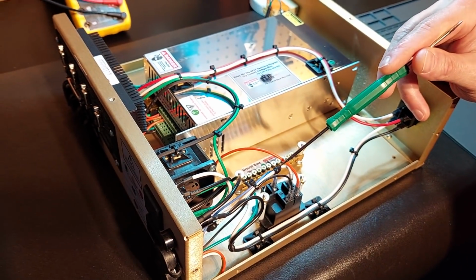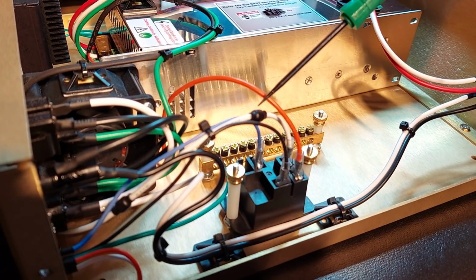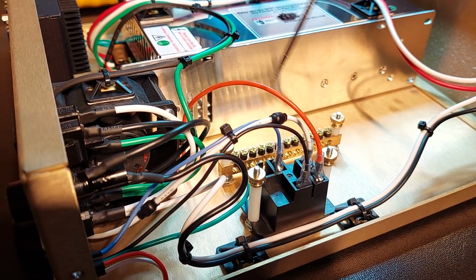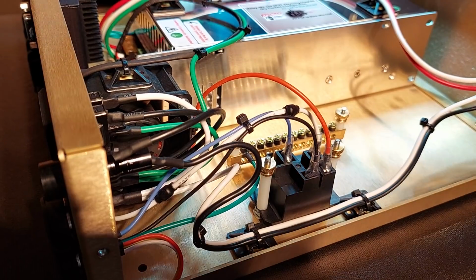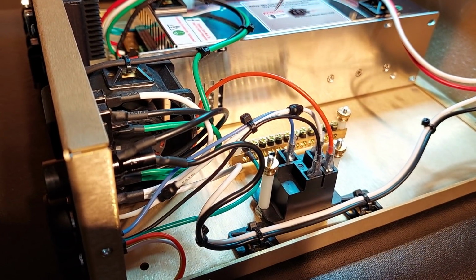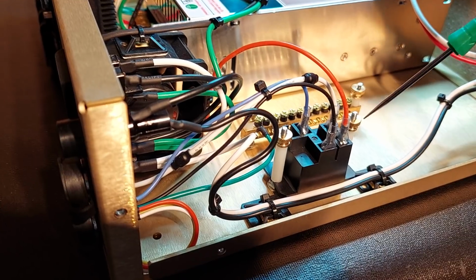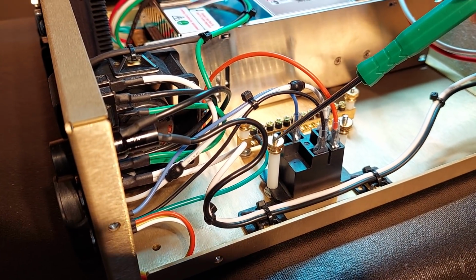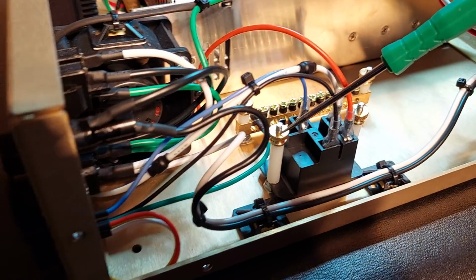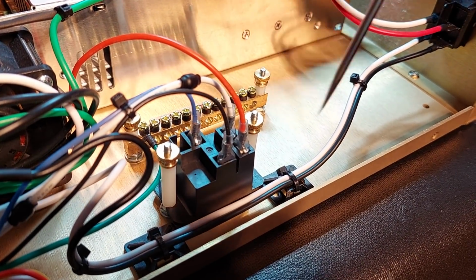What you see with these little nodules on this white lead going to the G540, which is the signal cable, is ferrites. So again, we don't have to use double shielded cable because he has ferrites installed all the way through the length of this cable going back to the drive. It's then toollessly mounted with thumb nuts to allow for simple servicing. If he had to change a relay out due to a failure, he could change this out in seconds. Okay, you can see these right here. They're just thumb installed as far as finger tight, and you're good to go.